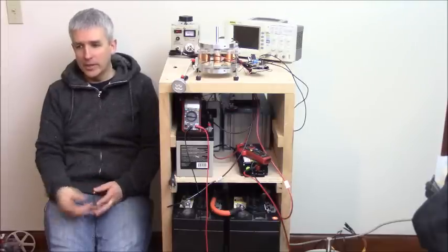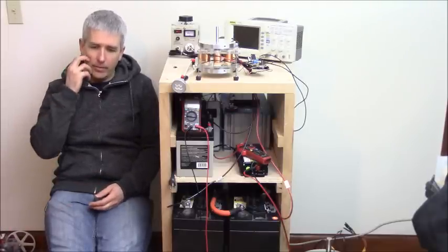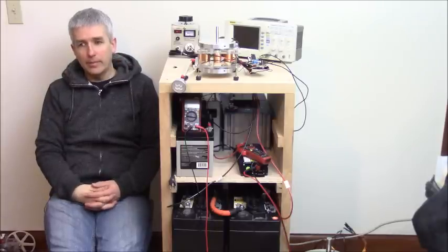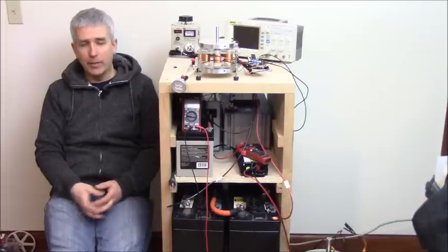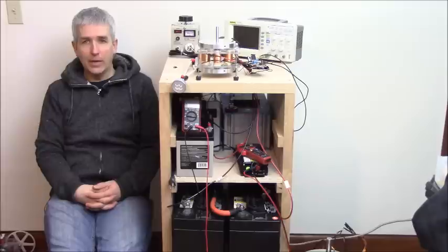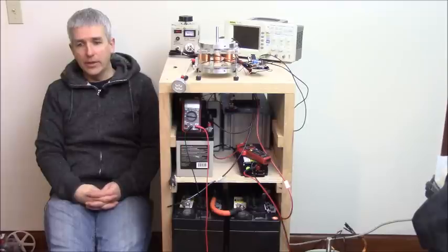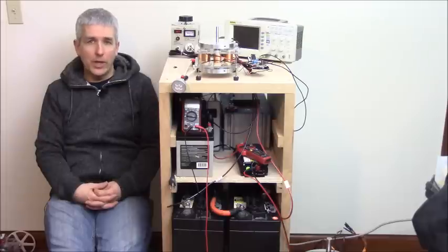The easiest way is to just make the trigger coil option and run it that way, and then just discharge it with the bulb all the way down till the bulb goes out, and then charge it right back up, and do that 10 times at least, and then you're good. Then try and charge it up, discharge it again, try and charge it up with a regular charger, and you'll see it's just not responding, like it's not putting any usable charge into that battery. So that's one way you can really verify.